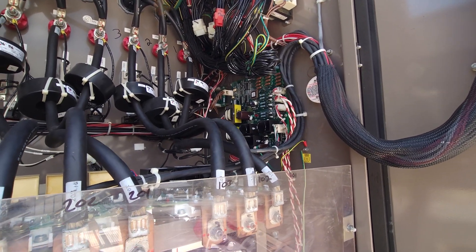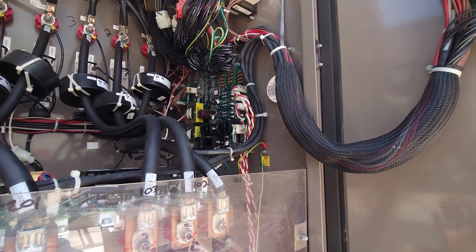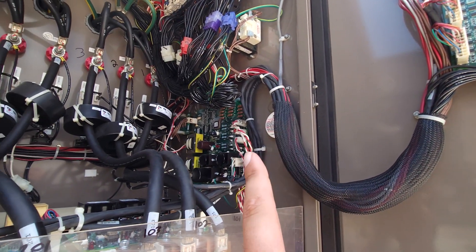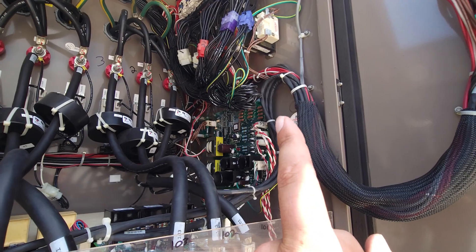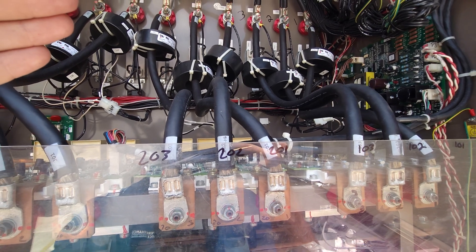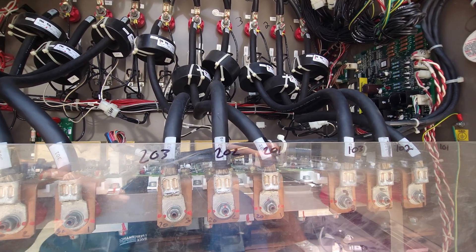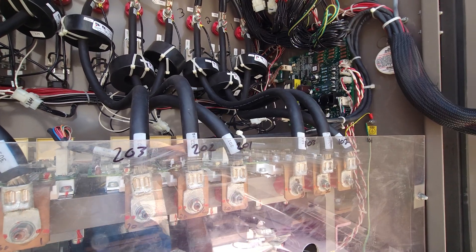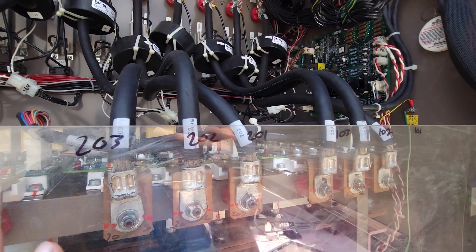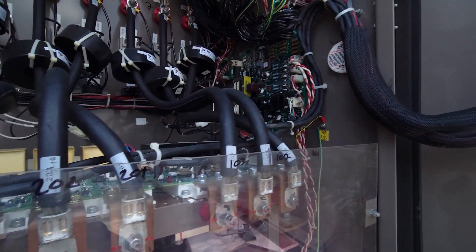This is not a customer that can afford any further intermittent failures — they need a complete solution. To recap: the logic was telling it to give an output, saying it was supposed to be outputting 50 hertz, but the trigger board never actually activated the IGBTs so that it actually sent the voltage through the gates. So the compressors never drew current and inevitably caused the shutdown. As an update — talking to the customer, when they came and reset it the first time over the weekend, they heard the drive components click and reset, but they never heard the compressors spin over, and it immediately went right back into alarm, which only further justifies what we're talking about.